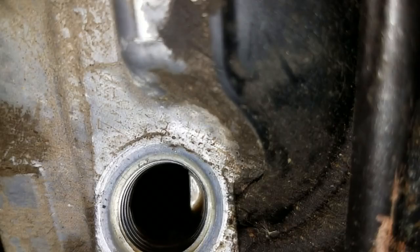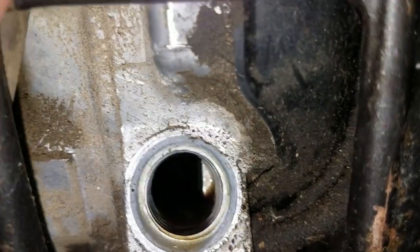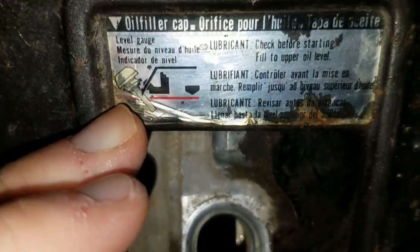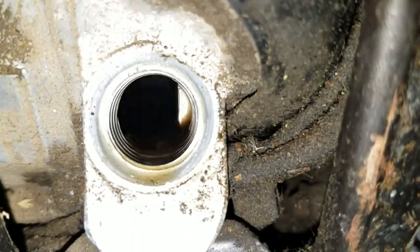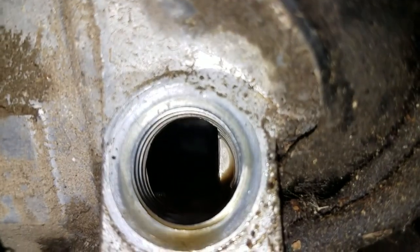For example, what I'm doing right now — you can see I'm preparing to change the oil. I checked this before I ran it for the first time. It had oil in it, and the oil looked fairly clean actually, but since I've run the generator the oil has become slightly darker, and between that and the oil just being several years old — who knows when it was last changed — I decided I wanted to change it. So mom was very gracious, donned a pair of rubber gloves and helped me. I put in high mileage 5W30.